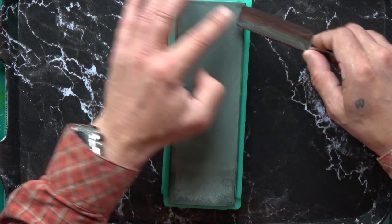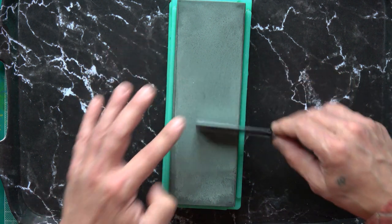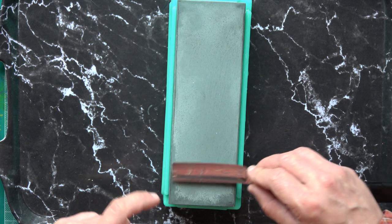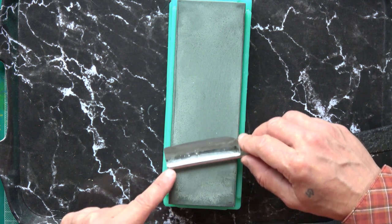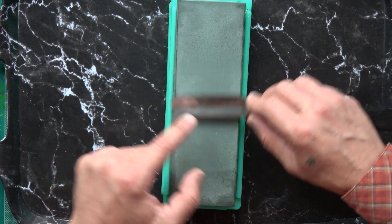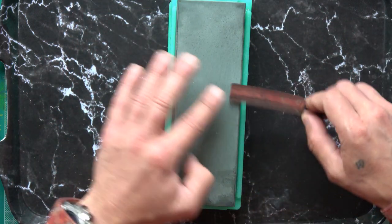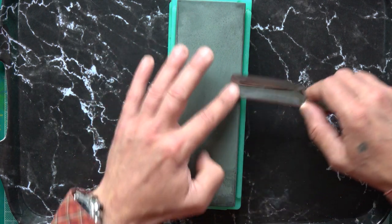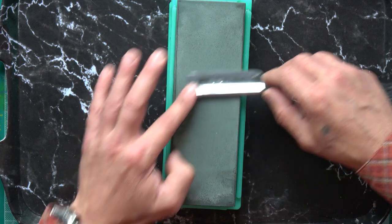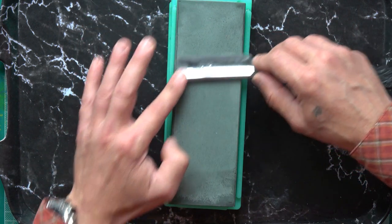It does feel like that's biting a bit more on the toe now, on the lap. Because it's the face side that's the problem, and on the toe. So when I was doing my face side lap, I was feeling it release, like the stickiness a little bit, but it feels like it's kind of grabbing it a little bit again now. And all of that feel is indicated and confirmed under the microscope.